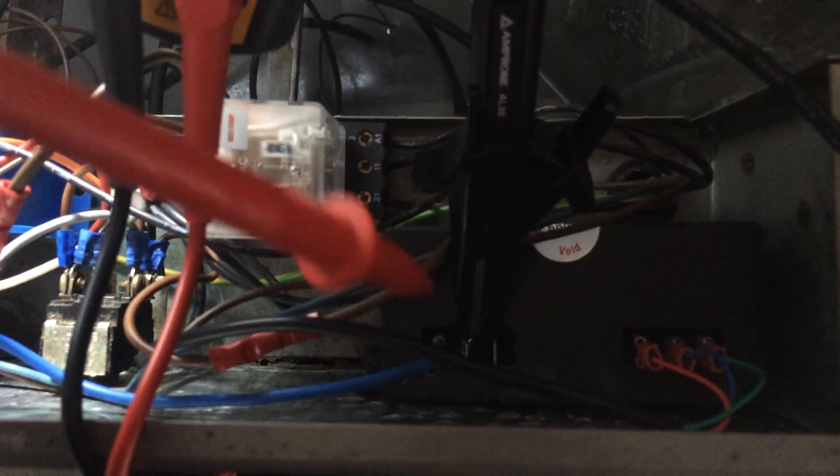What we found is even with the power off, the live in and live out will join together. I was putting my meter on — let me show you. Just by pulling the wires off, it's freed up the relay. It's live in, it's live out. Before I pulled the live off they were shorted out, so the relay is stuck. We'll get that control changed out and then see if we can get these water pumps thawed out.